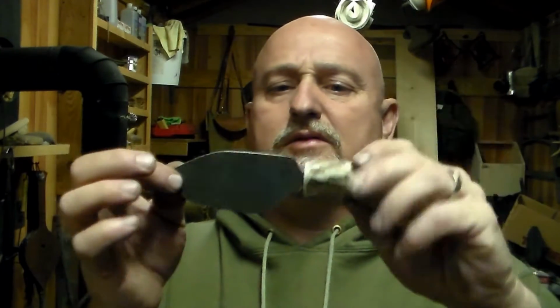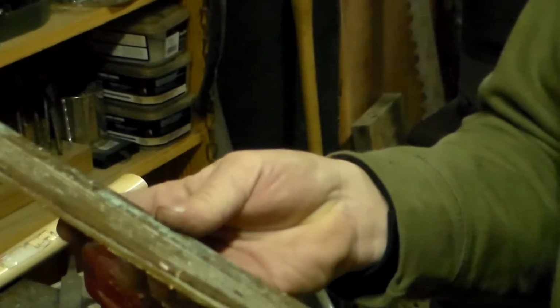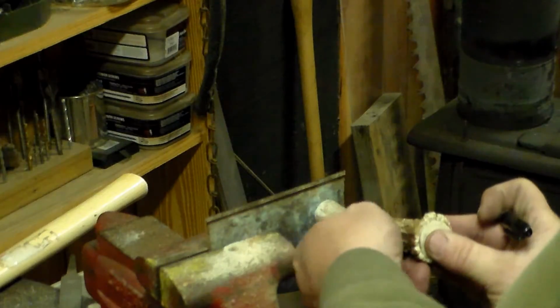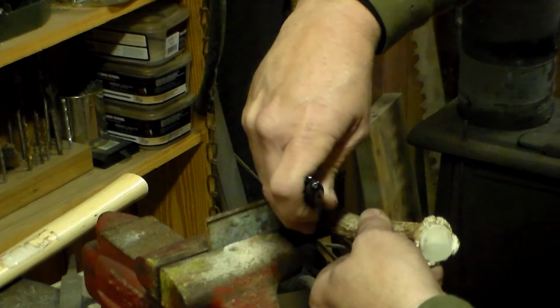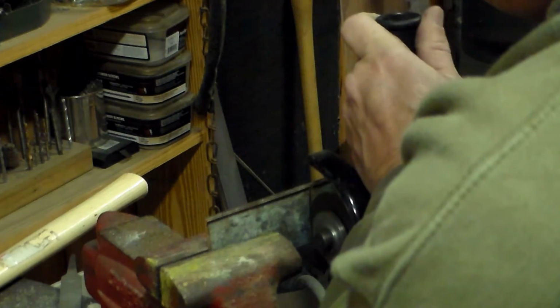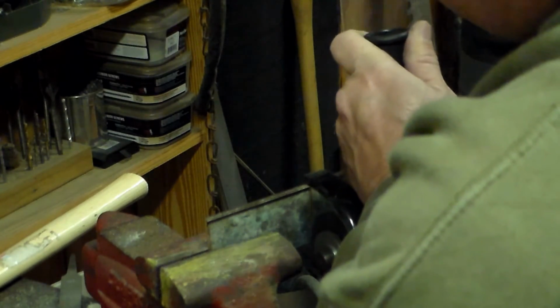We're going to make this one out of brass. I'm real bad about making sure that I never throw away anything. This here is actually an old threshold made out of brass. That's scrap. That's what I'm using on this right here. Just basically making a mark about the width that I would need on it. Then I'm going to take my die grinder and just cut it off, and that'll give me my width to start making my knife guard for it.